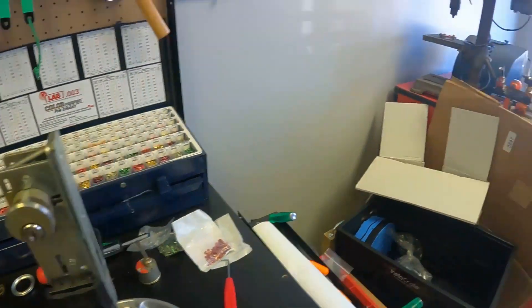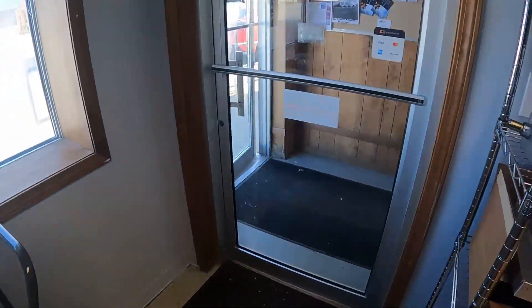Welcome back to the shop. Today I'm catching up on something I've put off for a long time — the storefront lock. I took over this place, rekeyed it and gave the property owner a key, but the outside cylinder, inside cylinder, and storage cylinder are all different keys. I'm going to put the GMS MX13 keyway in here and get everything lined up on one key.